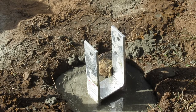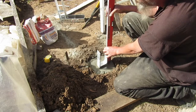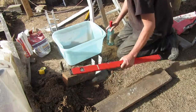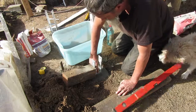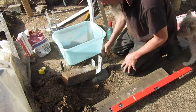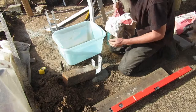My stupid dog — now you've got cement all over him. I'm going to mix up just a tiny bit more here. I want to build this up so that it's covering the bottom of that bracket, because that's all it's got to hang onto. The post holes are up here, so even if I come up above ground level and just slope it up, at least it'll have all of that to hang onto. I want to do it while it's still wet so the new stuff has a chance to bond with the old stuff.